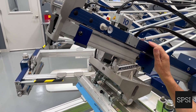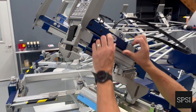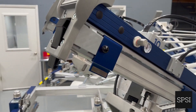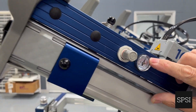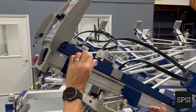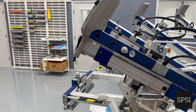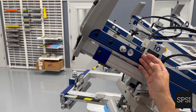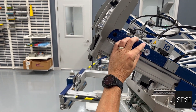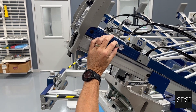On multi-colour wet prints we don't want to step on any wet plastisol ink with excessive force. Coming straight from the compressor we have around about 80 psi, which is maximum, but this plastisol will still get pushed through a 280 mesh at around about 25 psi. So our operating window is somewhere between 25 and 80. The water-based inks will still transfer through this mesh at around about 10 to 15 psi.